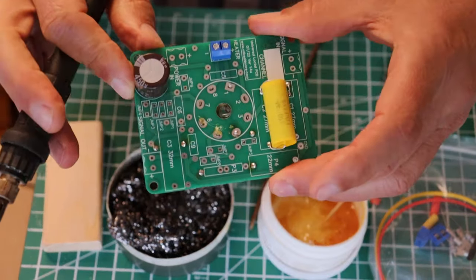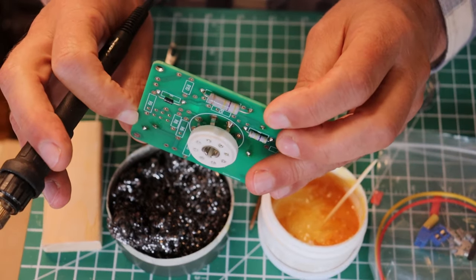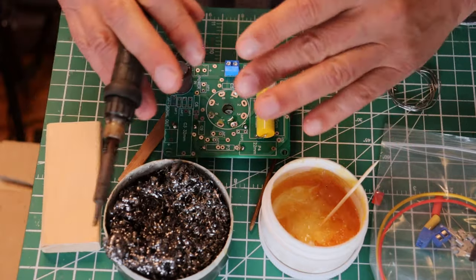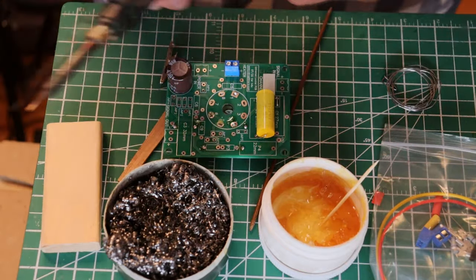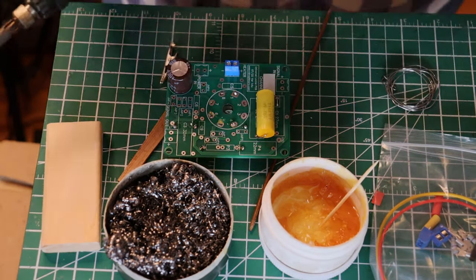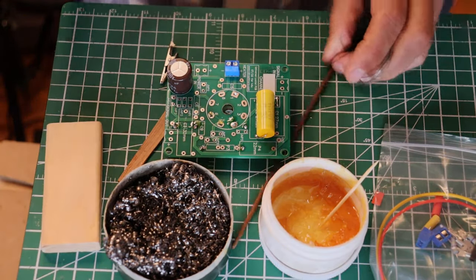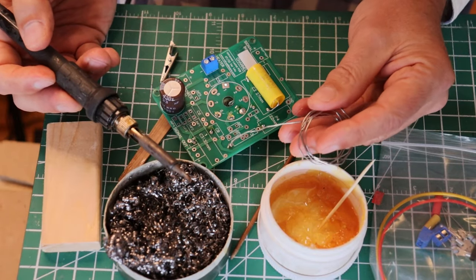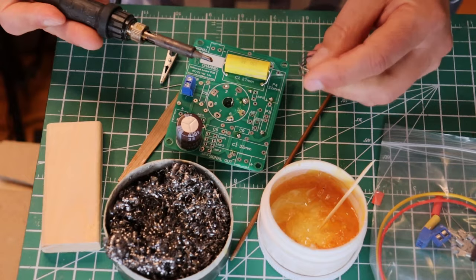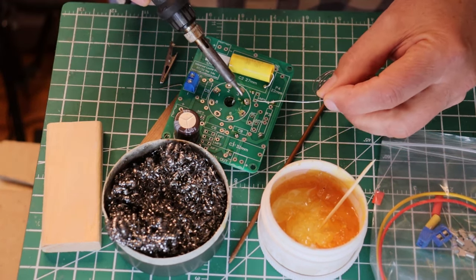Let's take a look at what happened. I put a fair amount of solder on and look — there's almost nothing left. Where did it go? It flowed right through as a big blob. It's not a disaster yet, but what we did was we put too much heat and the solder basically just washed away. So let's turn down the iron from 390 to 380°C, which is 710°F. These conversions aren't exact but they're close enough. You could go to a heavier gauge solder, and that would actually help a little bit, but most general work is done with a fairly narrow gauge. Controlling your temperature will probably solve the problem.